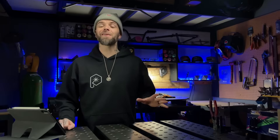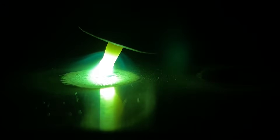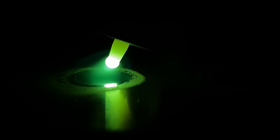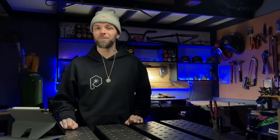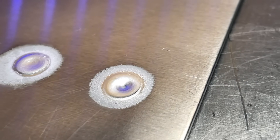So here's what I went over with the other student. When starting somebody into TIG welding, we do something very simple. Doesn't look like much, does it? With this exercise, all we are doing is practicing arcing up, learning to establish a really good and controlled puddle, and then extinguishing it properly with good control. If you're first starting to TIG weld and not familiar with the process, paying attention to all the different things you have to watch for can be really overwhelming. So this exercise is the perfect one to start with.